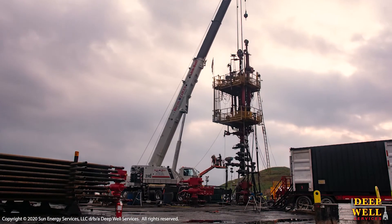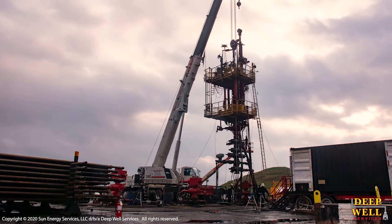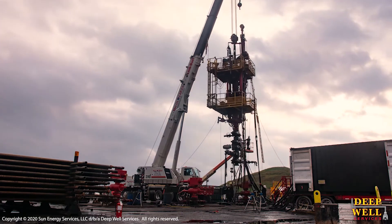But what happens on wells after we finish well one and we skip to the next wells — two, three, four, however many are on the pad — we can utilize our one-pick technology, and that enables us to break off the flange, the primary BOP flange from the frac valve or the master valve, and lift the entire package in one swing.